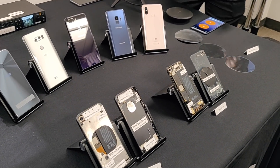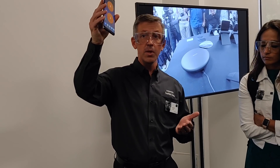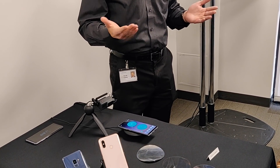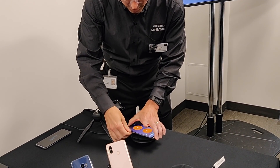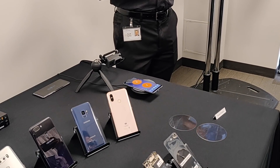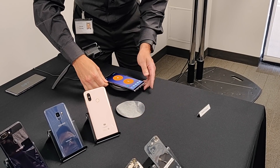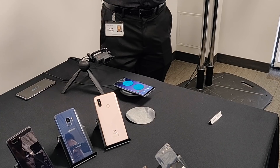The other thing to highlight from a science perspective is wireless charging. I have a device here with an app installed showing the electrical charge status — two circles representing volts and amps. If it's orange, it's not being charged. When I put it on this fast charger, it changes to green, meaning it's charging as expected. But if I take a thin piece of metal — this is 50 microns — and put it between the charger and the phone, you can see charging is not occurring. The metal interferes with the electromagnetic field used by inductive charging. If I remove the metal, glass being a dielectric, even with multiple pieces of glass between the charger and phone, it goes back to charging again. This is one of the main reasons you're seeing glass adopted on backs — it enables wireless charging and provides RF transparency.